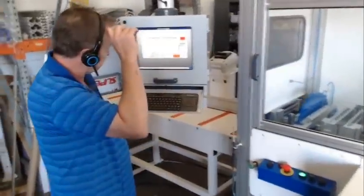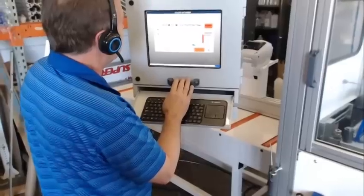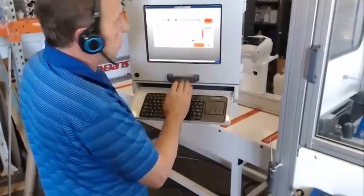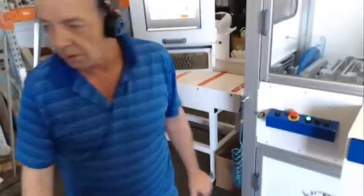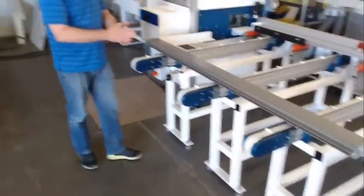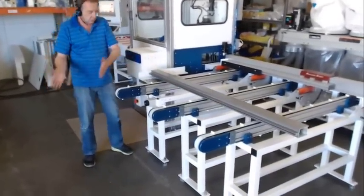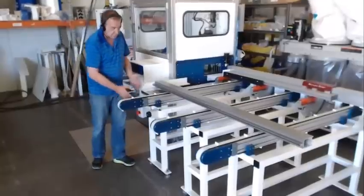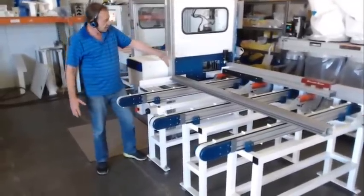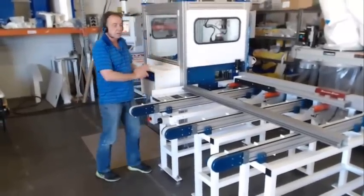Now it's optimizing the parts. The stock length I have is 76 inches max. In the real world with two people, you put a piece on the autoloader, hit the advance button, then load the next part, hit advance again, and fill up the conveyor. It has a full switch when it's full, so one part can always be fabricated while the conveyor is being filled.